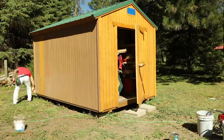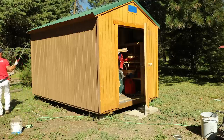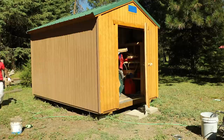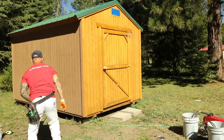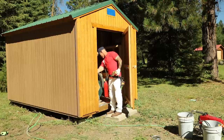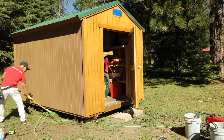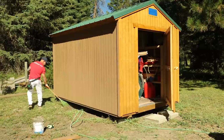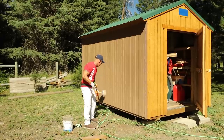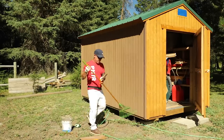We've got this one side all done. Now with staining, you only do one coat — you don't want to put multiple coats on there. If you put multiple coats, it could peel. So we're going to go around and do the front. Now this bottom down here — if you don't shield it, there's some overspray down there, but I can just take a rake when I'm all said and done and rake along here, and you won't even tell there was overspray down there. Being a shed, not a house up against somebody's house, that's going to be totally fine — right there with those rocks it looks totally fine.